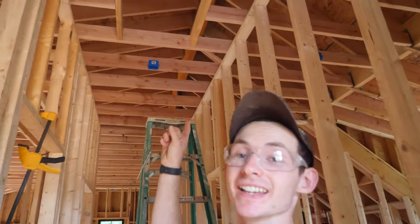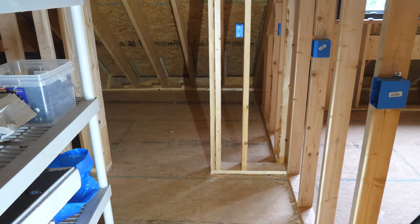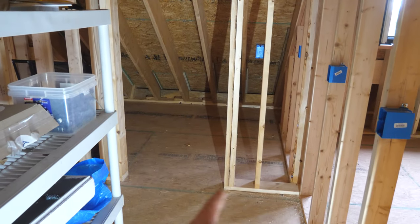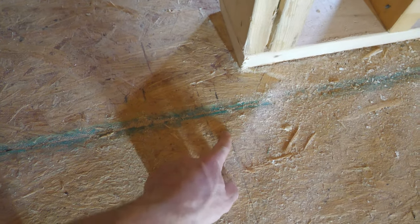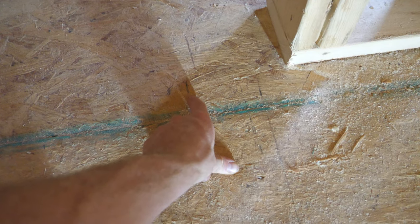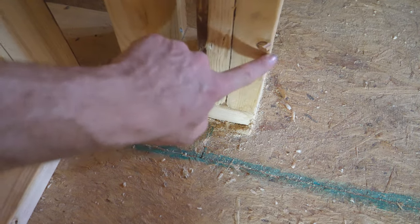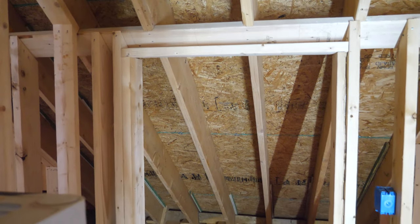Attic hatch is done. Next — pantry door. The original plan for this pantry was for me to build custom cabinets to go right here, but the plan has changed and we're going to get them from the RTA store. So 24-inch cabinets it is, and that door is going to be in the way. The edge of a 24-inch cabinet will be right there — with about an inch overhang for the countertop — and we are into our door opening. So I've got to move the door opening over. I want at least three inches from the edge of the countertop for trim. I'm going to make this the new king stud, take this jack stud and move it against the king stud so my new rough opening is right at this line, make a new little header plate, and we will have effectively shifted the door to the left.